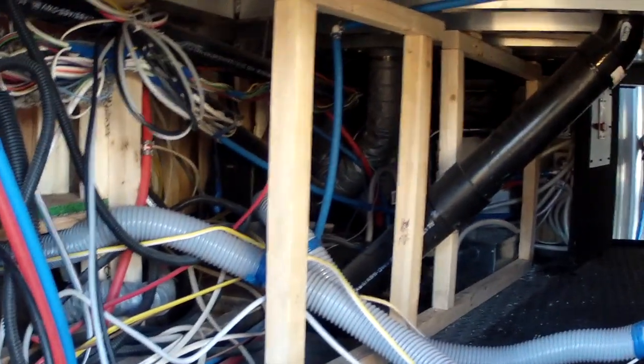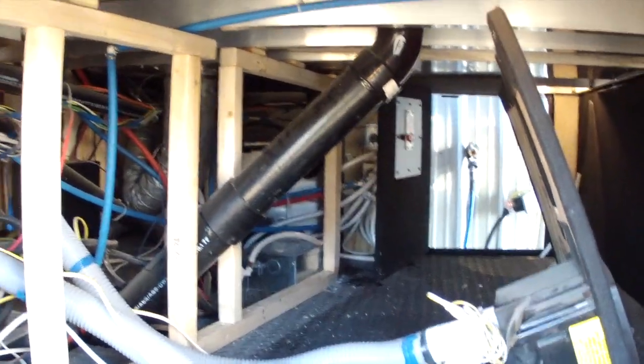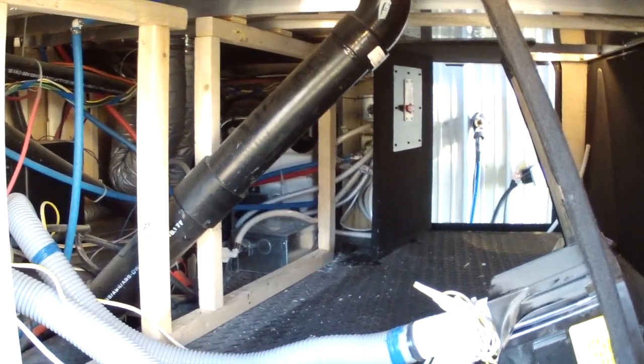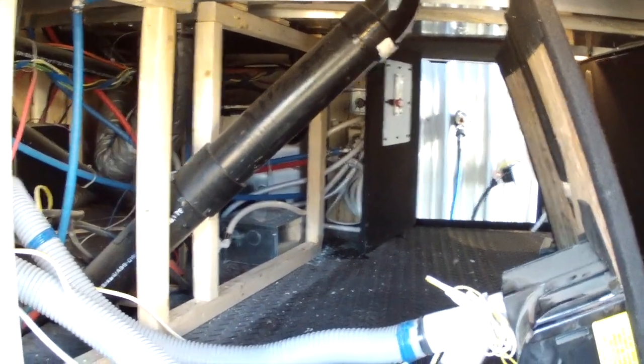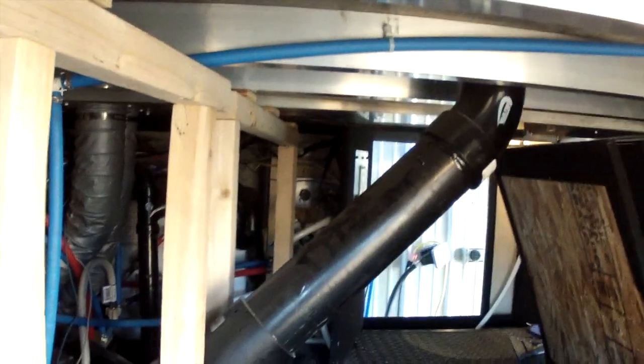Here is the adjusted frame for the back wall of our storage area. I increased the size of the opening on the far side of the drain pipe to make room for the water filters and have access to the relocated water pump. Beyond that, I will add a second hinged panel to access the back side of the Universal Distribution Center, water valve connections, and the transfer switch. By moving this frame, I added about 5 inches of floor space across the width of the storage area, or about 3.5 square feet.